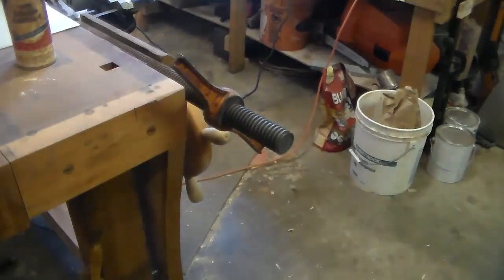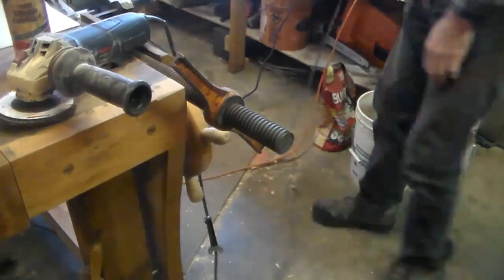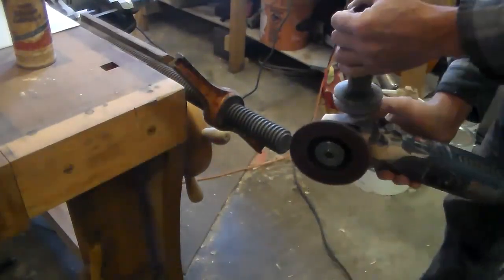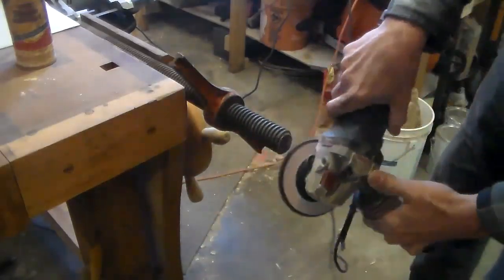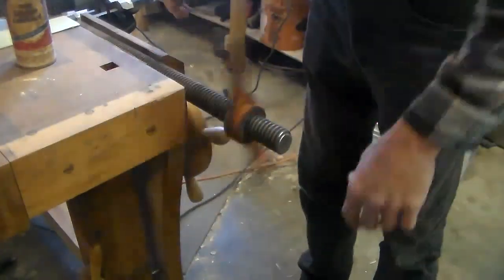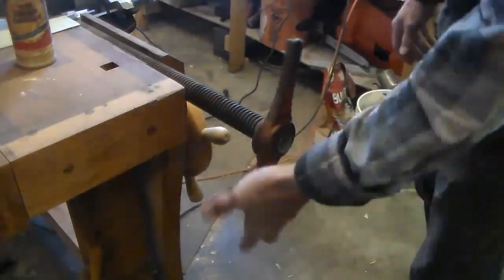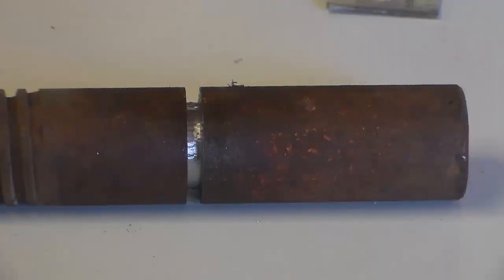because this one on the other end is a solid bar, and I actually took it into the metal lathe and cut a channel around it, which will allow me to trap it with the washer on the chop for the vise. And I'll show you a picture of it. I didn't actually film the metal lathe part of it, but there's a picture of it.